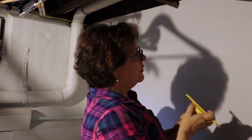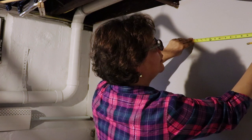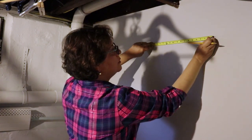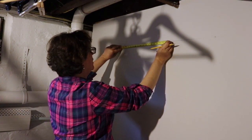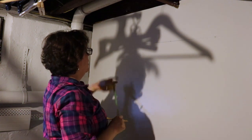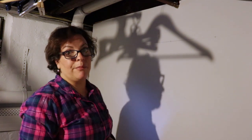They want one anchor every 11 inches. The first one is at two inches, and the next one is at 11 inches. I don't want the shelf to be too low. Let's see how many I'm going to be able to put — so the next one goes here, then here, then here. So I'll have one, two, three, four, five of them.